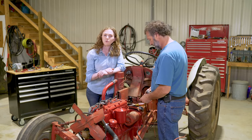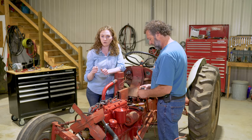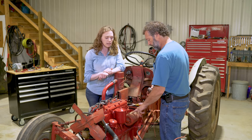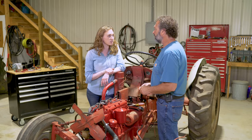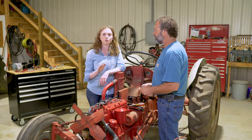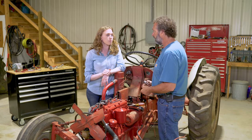There are some people who can quickly diagnose electrical problems if you're following up on someone else's bad 12-volt conversion, but if you're chasing down somebody else's bad 12-volt conversion, it's best to just take it all off and start over fresh wire by wire. It's not a hard wiring harness — there's only five or six wires. You can just start over from scratch and I think it'll be a better product in the end.